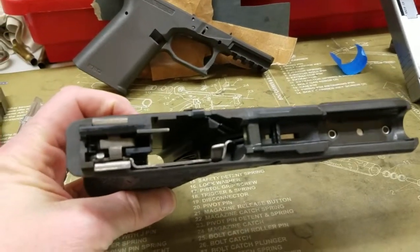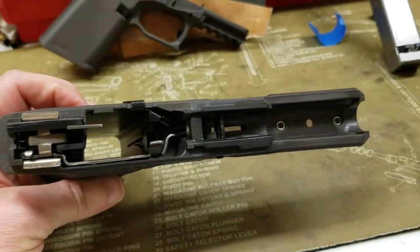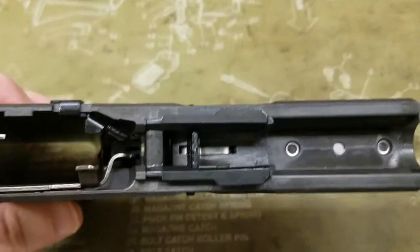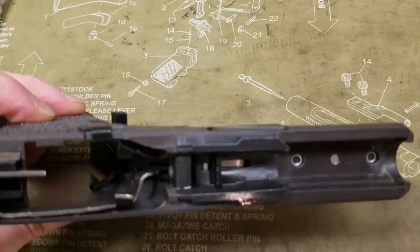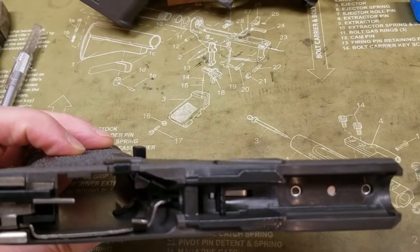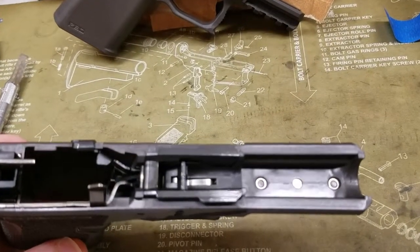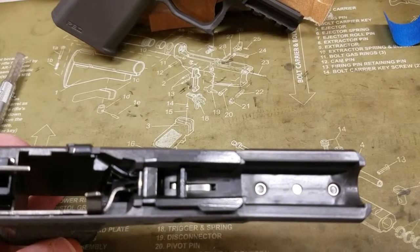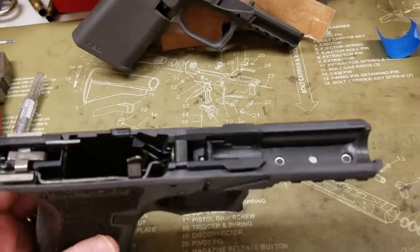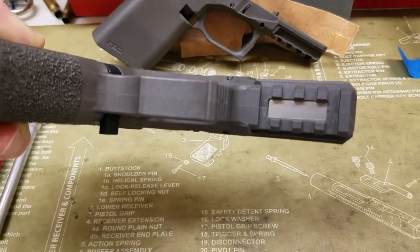This frame — the milling process was a lot better. I'll point out that for the slide block in the front where the recoil spring goes, you have to remove a little bit more material than the guidelines say. You can see on the actual frame you have to remove a little bit more so the recoil spring will work freely inside there — not a big deal, you'll see once you see how much more material is inboard of the metal insert. Also, these come with a little plate in here if you want to engrave a serial number on it.